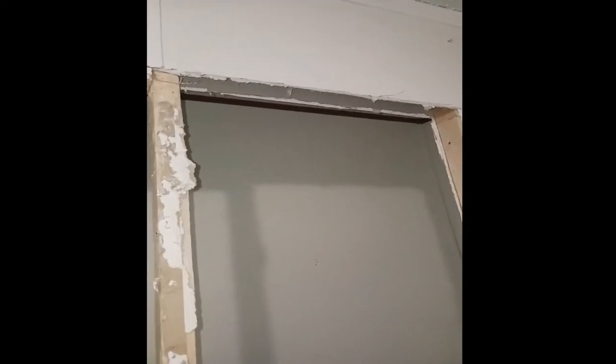Because this top plate is already on this side of the door, I'm going to have to cut that one to fill this side of the door. And because it's such a light wall and that stud is there, I will have to brace it against two filler pieces here, and I'll consider that like the king stud right there.